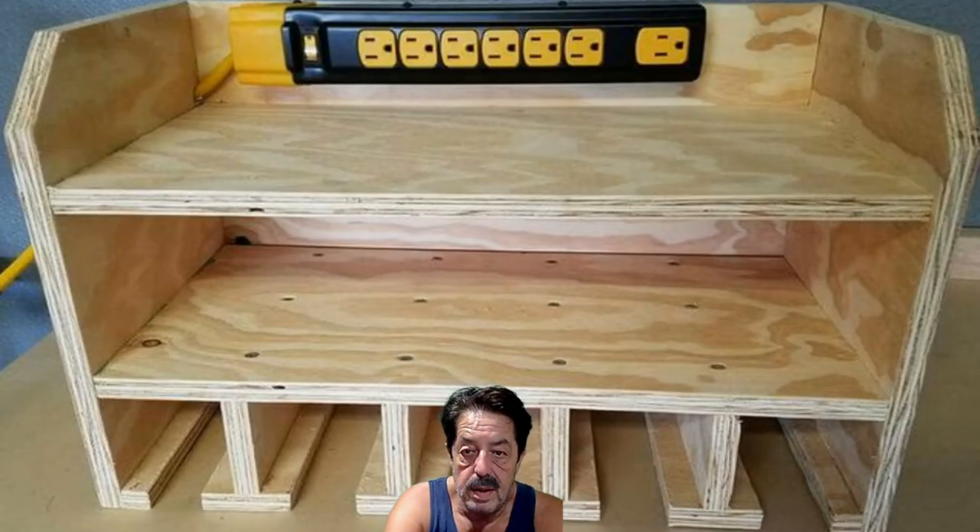Here's another idea where somebody attached a power strip to it. I made one of these at another house using leftover plywood — I didn't knock those corners down at that 30-degree angle, I made it square, and I didn't put the power strip on. There was some excess three-quarter shop grade plywood laying around. I cut it up quick, used a hot glue gun to tack things into place, and came down through it with screws. This is an easy project you can make from scrap wood.